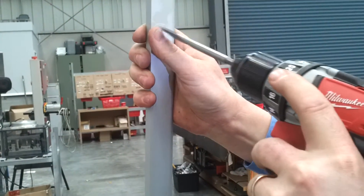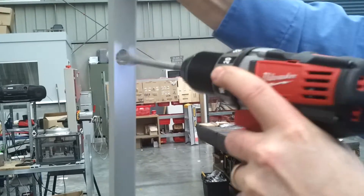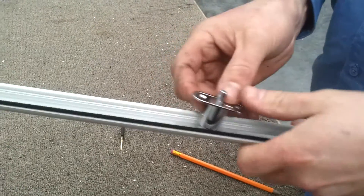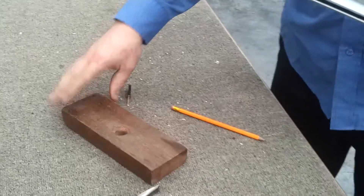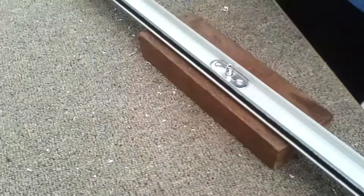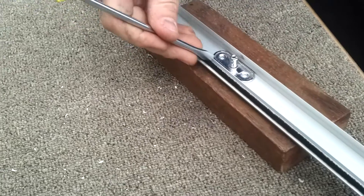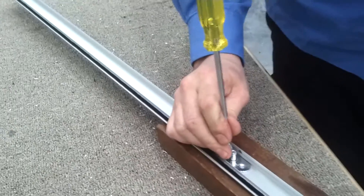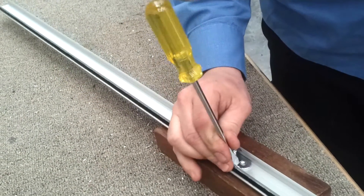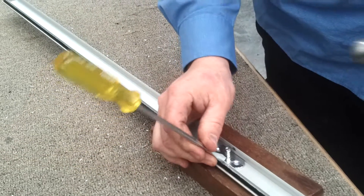Going to score this side out, turn it over to the face, and we do the face last — it's as easy as that. Now I'm going to place the lock from the inside and push it through. I've got a little jig with a 20mm hole in it so the 19mm lock fits in nice and easily. This ridge here has been made so we tap the lock down — it simply just pushes over and that locks it in place. The other side has already got a groove that the lock locks into.